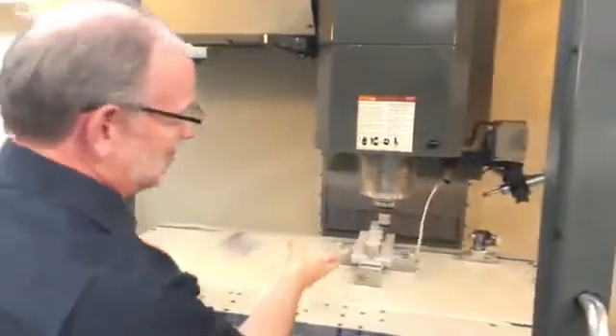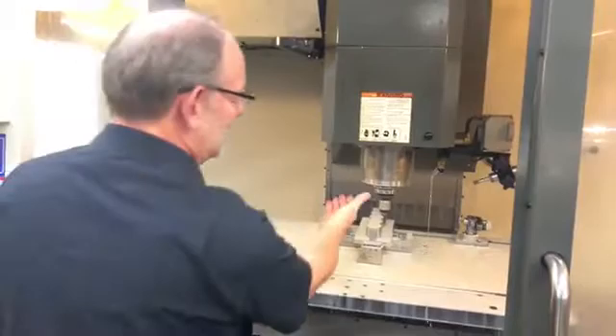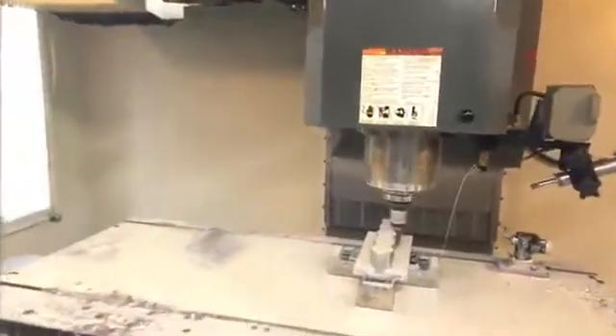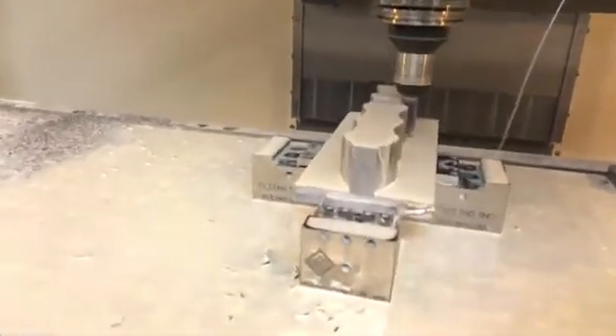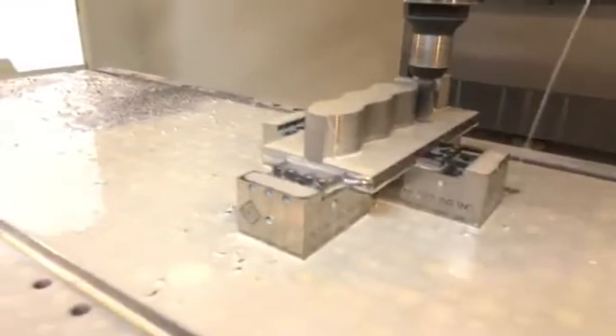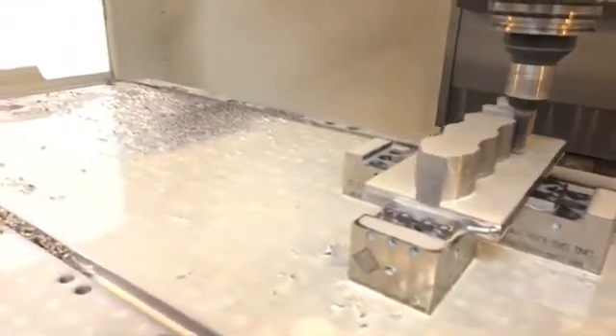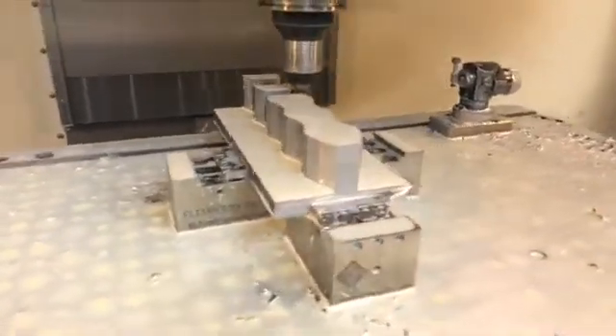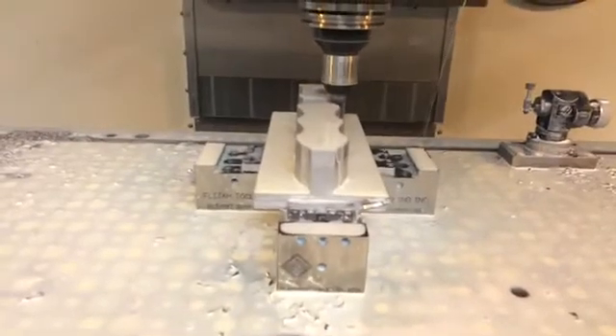So what we've got is four flex vises holding this block, and you can see that the block is bigger than what's typical for a dovetail vise. That's what's cool about the flex vise — it can be driven from both sides and it has gripping from both sides of that pusher. I thought I would get that out there before our competitors start copying this particular feature.